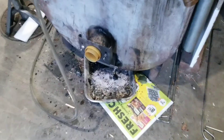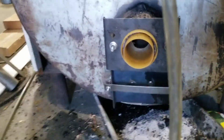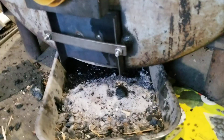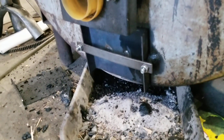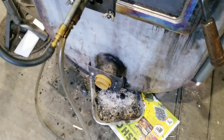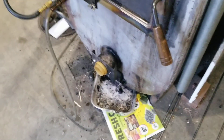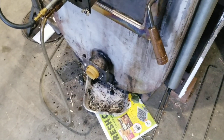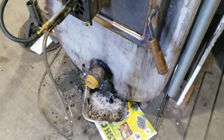The bottom is the air intake that's adjustable. Right now I have a restrictor in there that restricts the airflow, and below that is the ash clean-out port, so I clean the wood ash out of it. That pipe input there is a four inch pipe that runs through the back with several half inch holes drilled in it strategically to allow air for the wood burning.